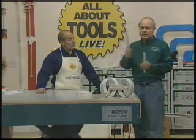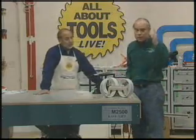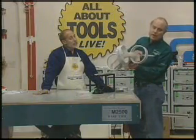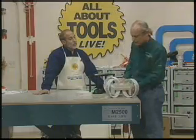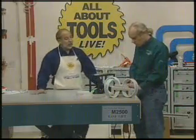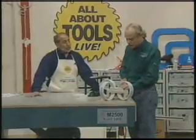What I do is I cut strips 1 1/16 inch, and then I glue them together on aluminum U-channel, but I have some fabricators that have made up a piece of MDF with laminate on it, and they glue all the strips together like this. So you've got like a 12-foot extrusion? Actually, it's 16 foot. 16 foot, okay. And that's something that is obtainable in most areas? Right. Most aluminum suppliers will handle that.